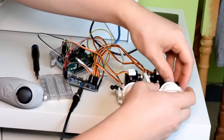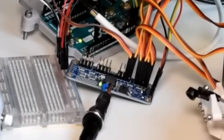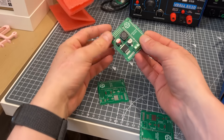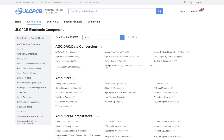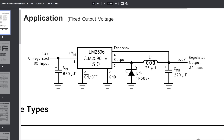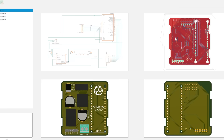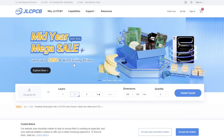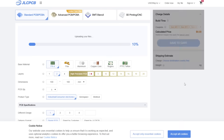I wanted to improve my electronics situation. Up until now, all of my eye mechanisms have used the PCA9685 servo driver board, mostly because I was scared of electronics beyond Arduinos and shields. You can make a PCB which you can solder yourself, and it's actually super cheap and fast, but because I love the decadence of a pre-assembled board, I started off by browsing JLCPCB's library of parts to find a voltage regulator I could use to convert a 12-volt input into a 5-volt line, which the SG90 servos can use. Through the parts library, I was then able to find the datasheet for the LM2596S, and quickly design a circuit to house an Arduino Micro, with breakouts for the servos and inputs. Everything is powered from a single input, whereas previously I kept the Arduino plugged into a USB, or I sketchily powered it from the VCC of the servo board into the Arduino's 5-volt pin — which I honestly have no idea why that worked.